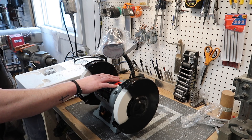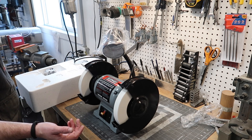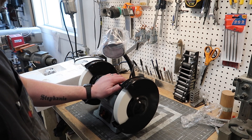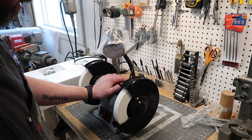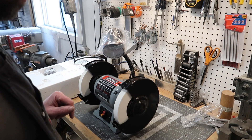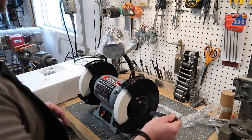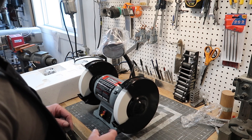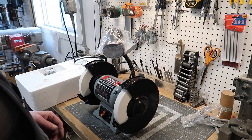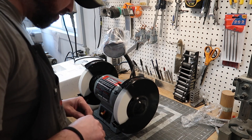A lot of imbalance in there — it's actually really bad. That is nice and slow, but I'm not a fan of that wobble on these wheels; they're fairly craptastic wheels. The one thing I need to check before getting too crazy is whether it has a 5/8-inch arbor, because the 8-inch paper wheels I have use a 5/8 arbor. Okay, let's try this — standing to the side — noticeably slower.